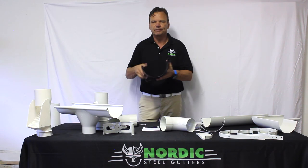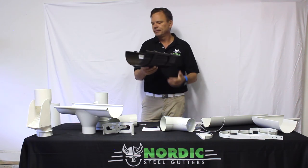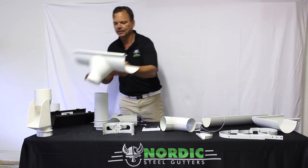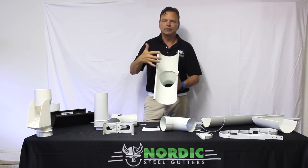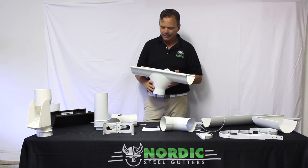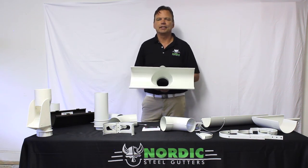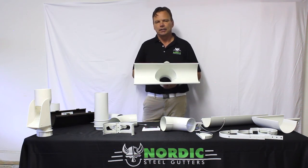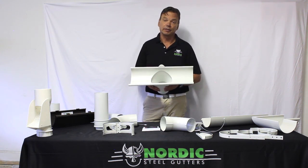We also do an 8-inch system, which is like a small bathtub for commercial purposes. Most commercial applications will do fine with a 6-inch system like this. All the water collects to the bottom and with this type of outlet hole you wash everything out and it evacuates very rapidly. A circular product — once the downspout gets full with water it creates a vortex, much like when you drain your bathtub or your sink: it starts rotating and then it starts sucking the water down out of the gutter. That does not happen with square or rectangular pipes, but that's also a benefit of having a half-round to a round system.